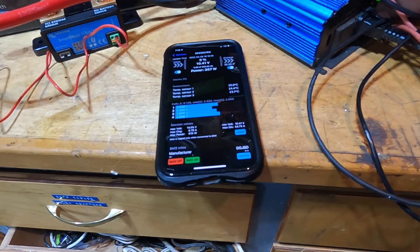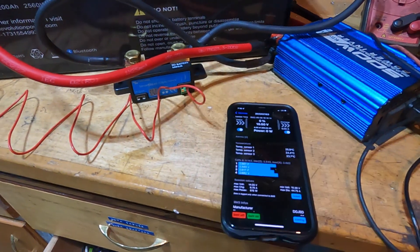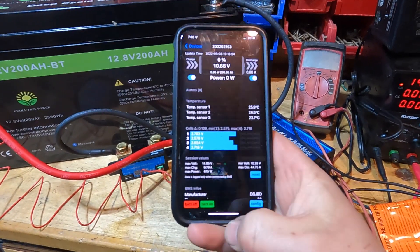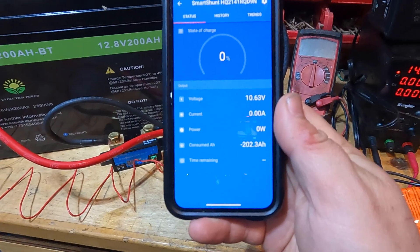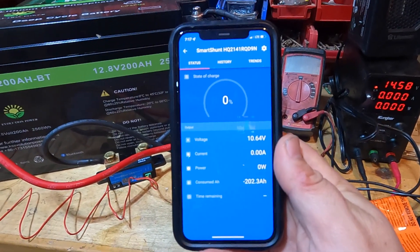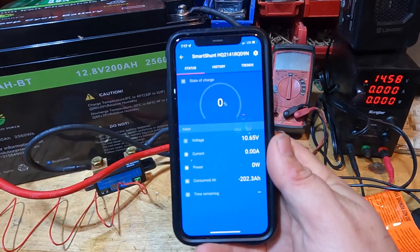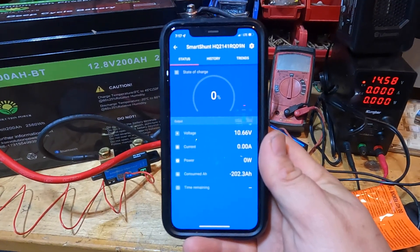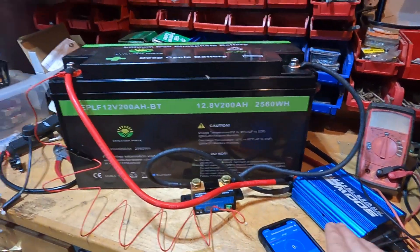I think we're almost about there. The cell voltage cutoff is at 2.5V. I'm going to kill it before that happens because I don't want the shunt to turn off. So this is where we ended up — this one has said zero for quite some time. However, the smart shunt has been saying something different. We finished up at 202.3 amp hours — that's not bad. Advertised at 200, we got 202. We were pulling about 34–35 amps towards the end. Ideally these test conditions would have been about 20 amps, so there is a little Peukert effect on the discharge side — you will get a little less capacity if you go over 0.1 C on discharge. But overall I'm very happy.